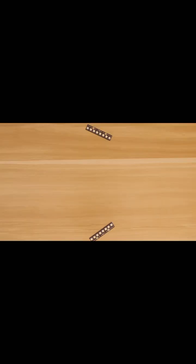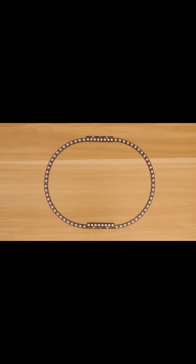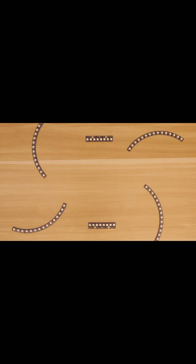By adding 2 NeoPixel sticks to a 60 NeoPixel ring set, we're able to make an over-ring that can fit over the phone. The signal from the NeoPixels can flow between different PCBs as long as the data in goes to data out. Here's how the circuit works.